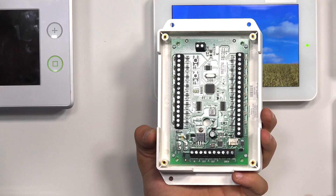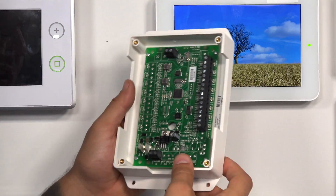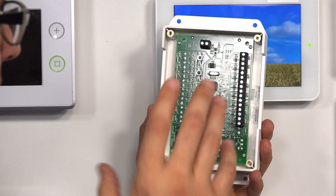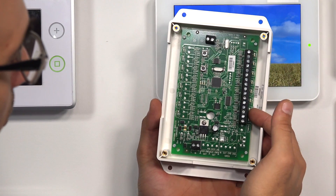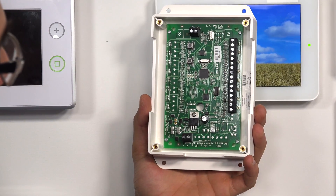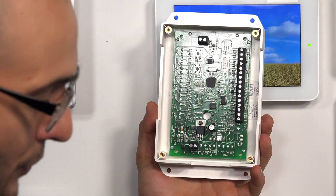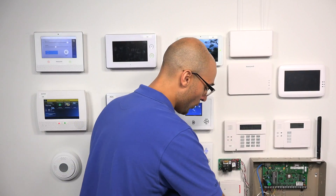The 8S, on the other hand, it doesn't have as many features as this. Let me show you what it looks like — I have it right here. So as you can see, the 8 has much less options when compared to the 16. You have your zone terminal block right here, which you can land your hardwired zones onto, and you have your power input. But it doesn't have those two ground outputs, and it doesn't have the siren out. So if you do require those features, make sure to pick up the 16 or the 16S for your conversion. They'll work exactly the same — they're just going to be encrypted when communicating with your IQ2 system, and they work great.